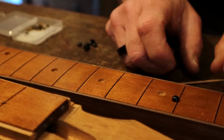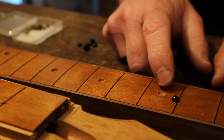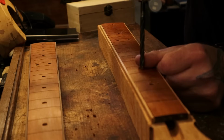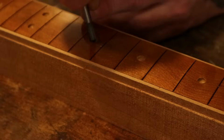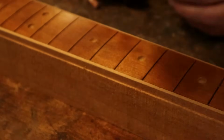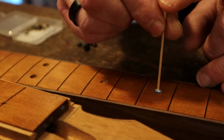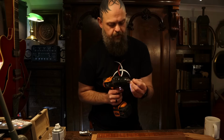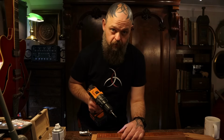Now, the holes we've drilled, it's a 3-part process because I do not have a 1/4 inch or a sharp 1/4 inch center point bit. So I've drilled with a 6mm bit, then gone in reverse with a 1/4 inch cutter, and then with a router bit just held between my fingers to round the bottom off of the cavity. I want these to stand just a little proud so they can be carefully ground flush. Of course, if you have enough self-confidence, you can put the 1/4 inch round over router cutter in your hand drill. Just, hey, don't mess it up.